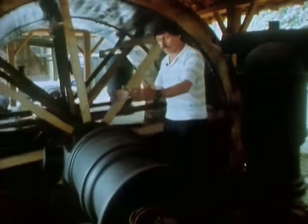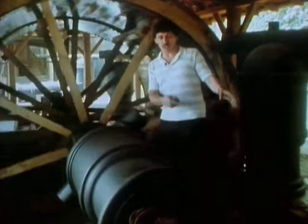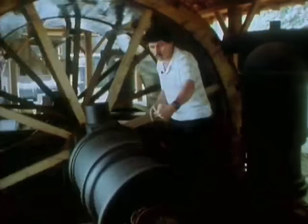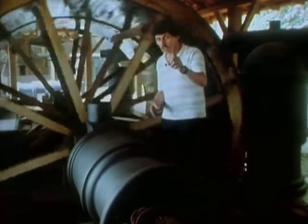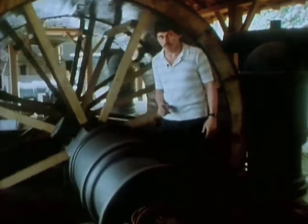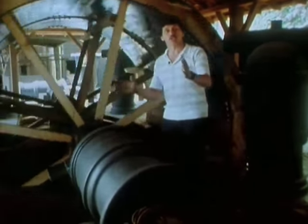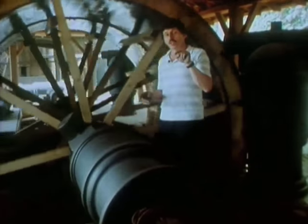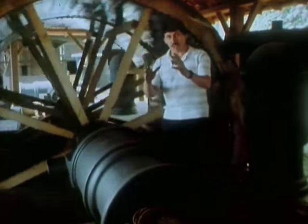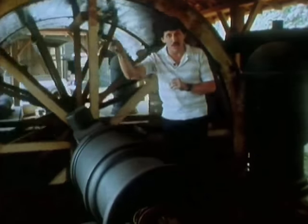On the mortar lathe, the solid hunk of metal — the solid mortar — was firmly attached to the water wheel, the whole thing rotated, and then the boring tool was slowly wound into the mortar itself, cutting a hole in the centre. Because the cutting tool was firmly attached to a flat bed, it was a very accurate method of boring. And it was used not only for the mortar, but also for the large coastal cannon. In fact, with this method, you could make a cannon so accurate that it could land a 32-pound cannonball accurately on a target at a distance of three miles.